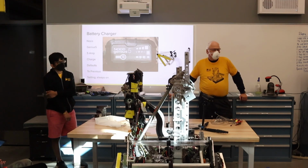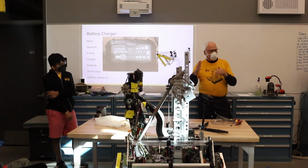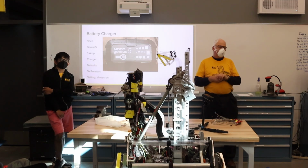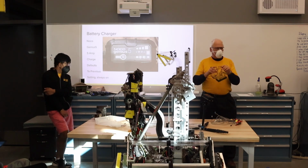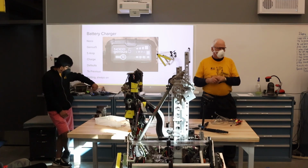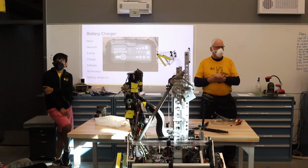What's the range, keep versus discard? So when I do this grade, I'm looking at two things. One is, what is the minimum voltage it ends up with? The higher the minimum during this analyzer session, this match simulation, the better. And then the ESR, the series resistance, the lower the better. So if it's above 20 milliohms, for instance, I'm going to get rid of that battery. I'm looking for something that's at least in the 17 to 18 milliohms range for my extracted ESR.